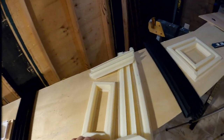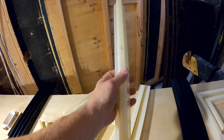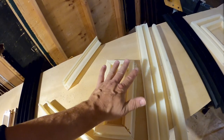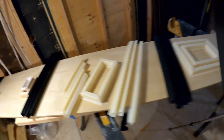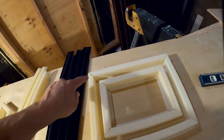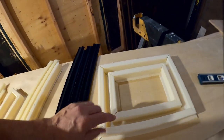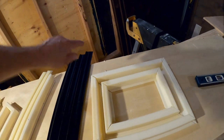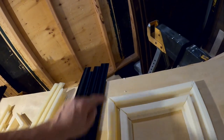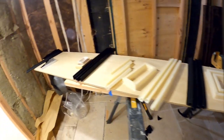This is our second panel — top left and right, a bottom left and right, center mid-wall section, and left and right sides. And this is how we boxed in our speaker grill. That would be a speaker, and this is going to be grill cloth. For number three — four perimeters, this is our Seymour screen opening, and the secondary outer opening is our fabric. For a full-size screen like a 120-inch screen at about 58 inches tall, you're not going to find fabric that wraps all the way around, so anything 120 and above you'll need to build a little panel to section the fabric. At 120 and under you should be able to use a solid piece and just wrap it.